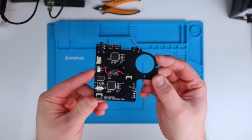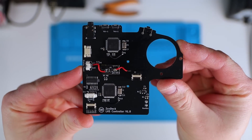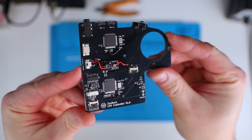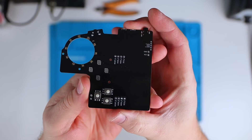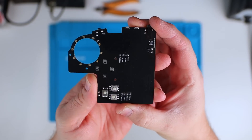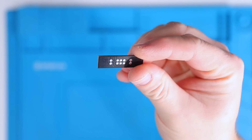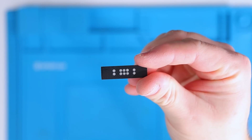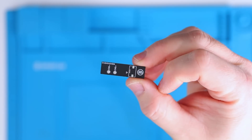This is the left controller PCB. I accidentally left out the 3.3 volt regulator from the design, so I hacked up one of my spare NUCDEC PCBs and stole the regulator section from it just to get this going. This PCB features a USB hub with up to four outputs — two are used by a pair of microcontrollers on the board for the controller and trackpad, and the other two will eventually connect the touch input of the display and the power management board. I've also designed a tiny PCB for the bottom of the console to enable docked charging and to break out the remaining USB ports through the dock.